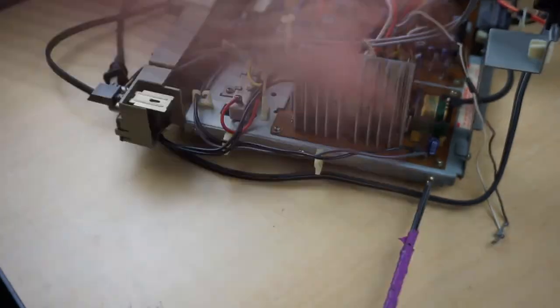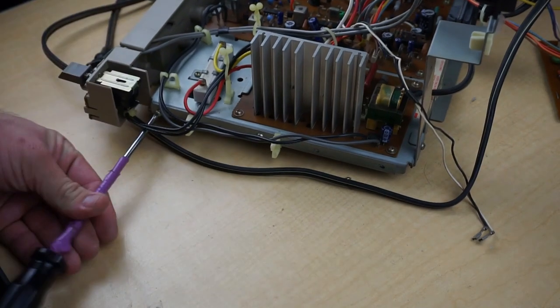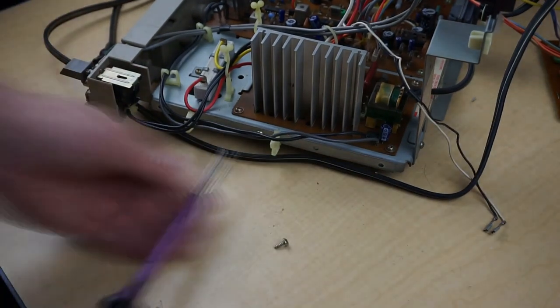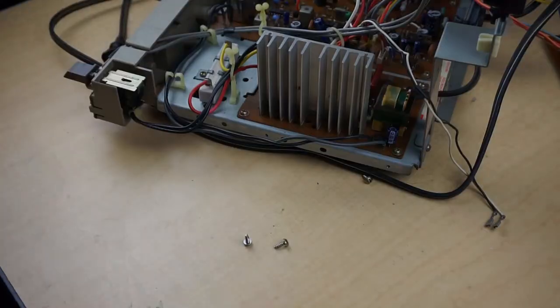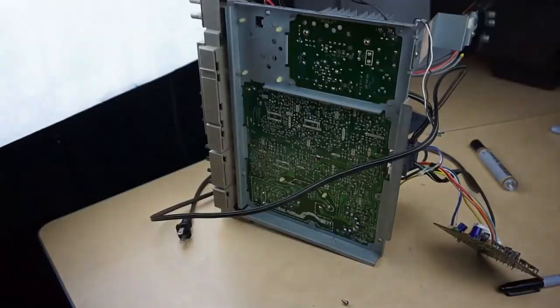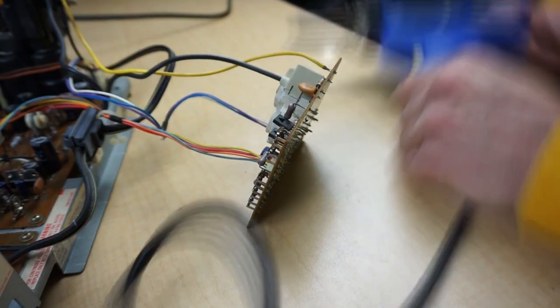But before we get into the details on the hardware, I want to show you some procedures to start working on this main board. First, you will want to remove this small piece of shielding that is next to the heat sink, right next to your main power block. That will give you a little bit of space to access some of the capacitors that are under there without actually removing these boards from the frame.